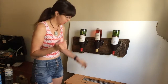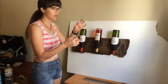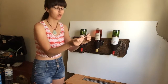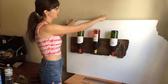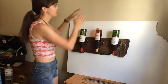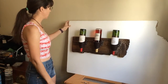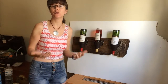Now it's the next day and I've got plenty of daylight to stage and photograph the wine rack. I sell most of my things online so I need really good photographs, and for good photos you really need daylight — the problem is I love to work at night. To install this wine rack I use two cabinet screws, 3-inch ones, through the pre-drilled holes, so the screw clears the width of the rack and has enough left to go into a wall anchor. Here I'm not using wall anchors because I'm staging it on a painted particle board board propped on my boyfriend's radiator box — so I can take photos and crop them to look like a real wall.